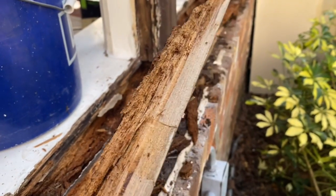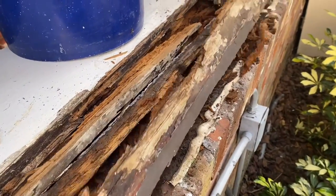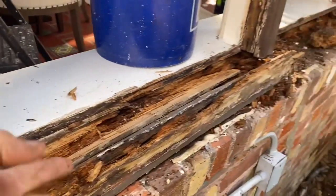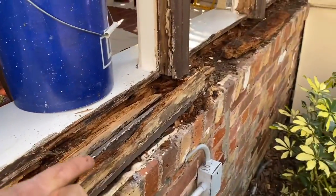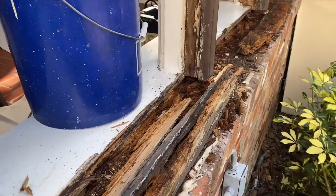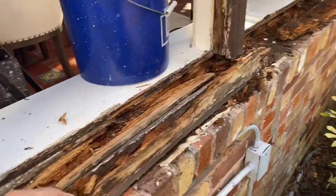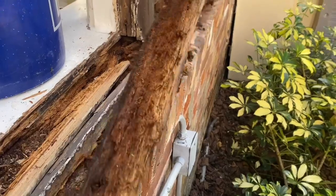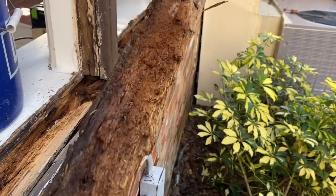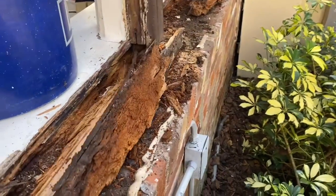But one of the things you need to know is that even the best wood, if you've got historic old growth heart pine or old growth cypress or whatever, it's no match for day in, day out moisture, fungal activity and rot. Even the best woods will meet their demise if proper protections, water drainage, all those types of things aren't thought of.